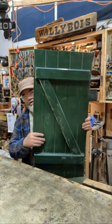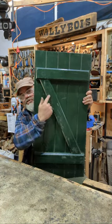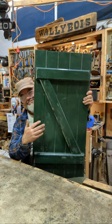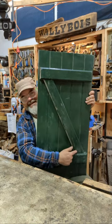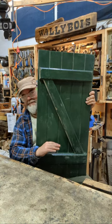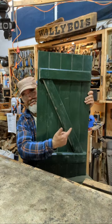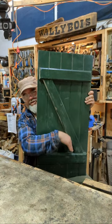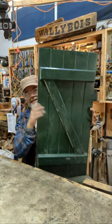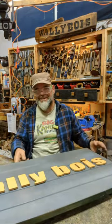So now you could say, why don't you put the hinges on this side? Well, it's not going to a fixed point, but it shouldn't sag. This is going to behave as a hanger, not as a brace, if that makes any sense. Basically, this will be holding up the shutter if you have it the wrong way round, instead of creating that brace which is like being wedged into the bottom corner. So if it's hung on this side, it'd be stronger than if it's hung on that side. So there you go. Was that clear as mud?